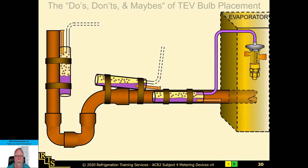These drawings show it done correctly. For a horizontal pipe, the connecting piece should be on top going back to the power head. Do not put the bulb on a braze joint or fitting because you won't get a flat surface and it will affect the reading. On a vertical pipe, it doesn't matter where around the pipe you place it, but you want the tail coming out the top. Horizontal, right out of the evaporator coil, is your best bet — on the side of the pipe with the tail on top.